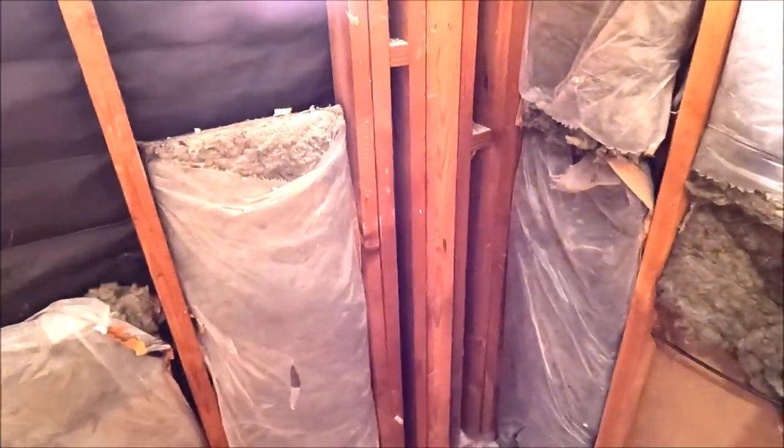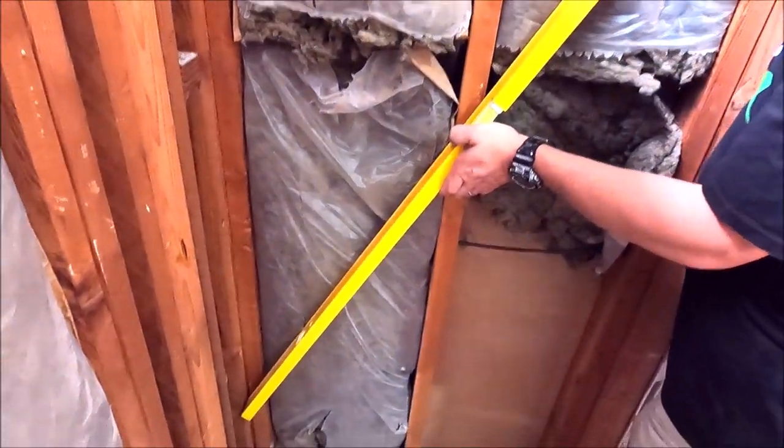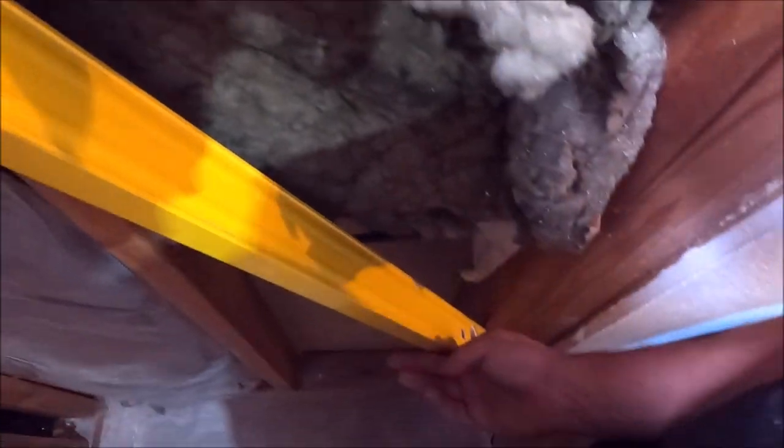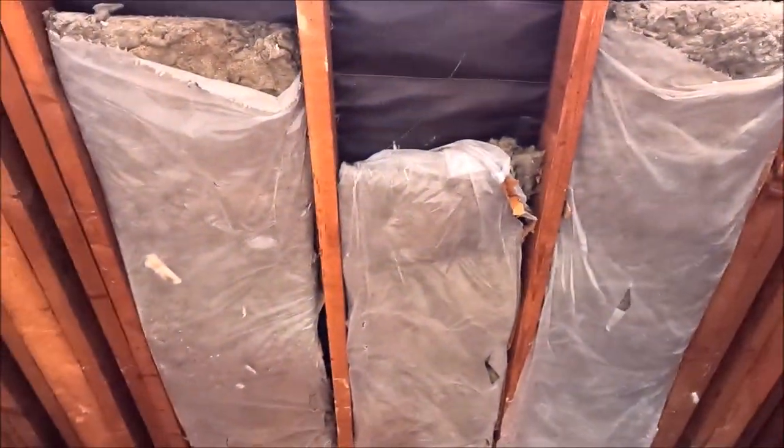We will wet shim this corner as well as the opposite corner. Let me show you how off the framing is and how much shimming is necessary to make all three walls flat. The side wall — flat, flat. Let's show you this gap down here: we've got about three quarters of an inch to make up and to shim. Let's show you the top left — again about three quarters of an inch.